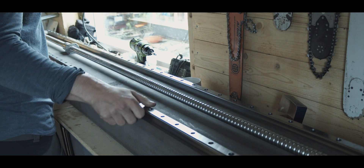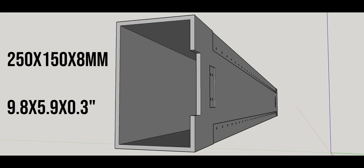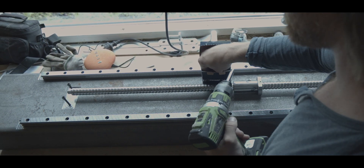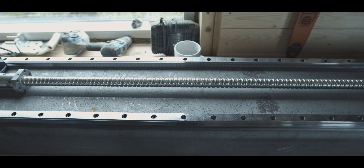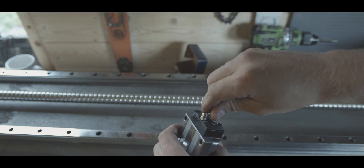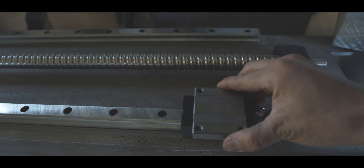We're going to begin with what was the easiest part of this whole build. I bought a big chunk of steel to use as the main gantry — a rectangular tube, 250 by 150 millimeters with a wall thickness of 8 millimeters. I had it sent to a machining center with a mill large enough to fit this 2.5-meter-long tube; both the top and bottom where the rails sit were milled flat, and they drilled and tapped all 80 holes for the rails and ball screw bearings. It actually turned out to be cheaper than buying a large aluminum extrusion, which is what a lot of CNC machines are made of.